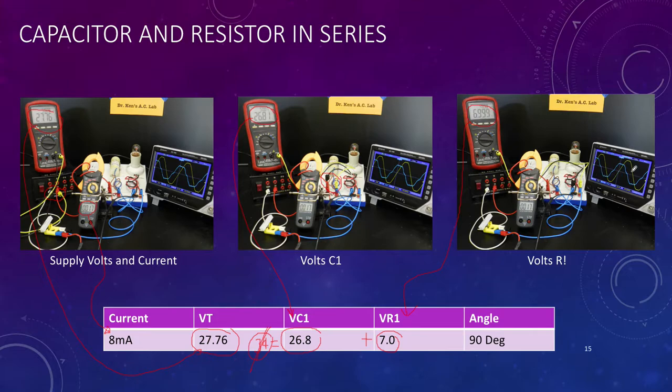If we now look at our oscilloscope, and if we look at the 2 zero crossing points, there's the 2 zero crossing points. I could have used any 2, but that's the difference in here. The period from here to here on our big wave, and all I did was put the difference in time divided by the period in time, there you go, period, and I multiplied it by 360 to give us, instead of the difference in time, the difference in degrees, and we find that the capacitor is causing a 90 degrees shift between the two.